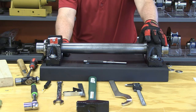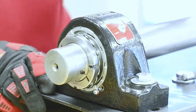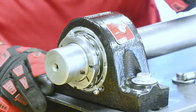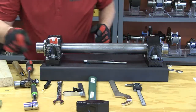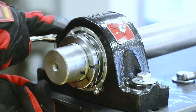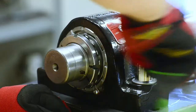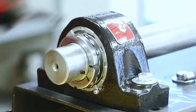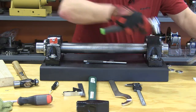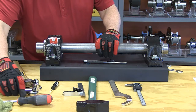If I have two fixed pillow blocks, I go over to the second pillow block and follow the same procedure. Once it's locked in position on the shaft, I can position my pillow blocks making sure my alignment is within plus or minus two degrees and all positions are good. Then I can go ahead and tighten my mounting bolts and the install is complete. Fairly simple — that was two fixed pillow blocks.